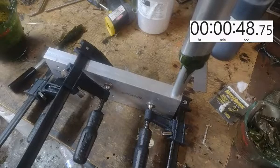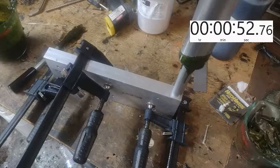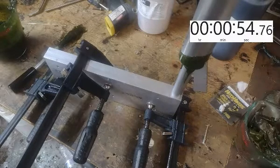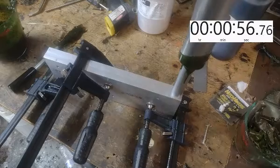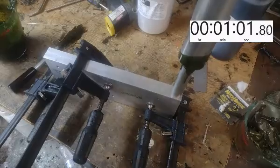The vents are only two and a half thousandths deep. That's what I found is the best depth — deep enough to always vent the air well, and shallow enough to not flash too badly.